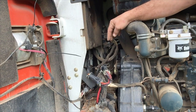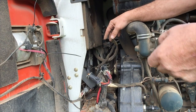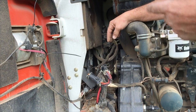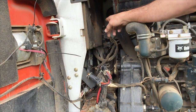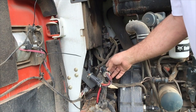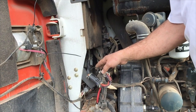Something to be aware of: when both are plugged in and you're trying to run a Genius controller, you may have the pumps starting and stopping — that's because the 14-pin behaves that way. You need to disable the pumps by putting a jumper between the K and L pins in the 14-pin connector, and that allows you to jumper it out and shuts the pumps off. Otherwise, you can just unplug the 14-pin portion from the back and plug the 7-pin straight in again to run our controllers.